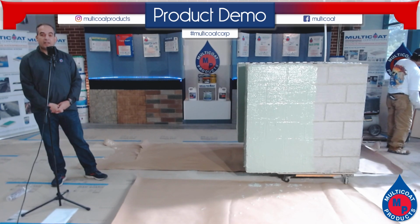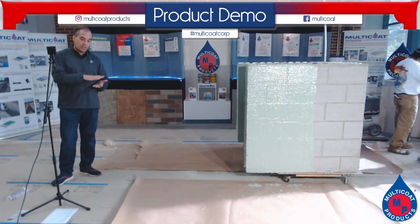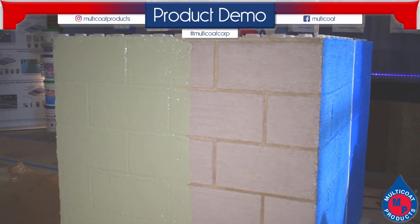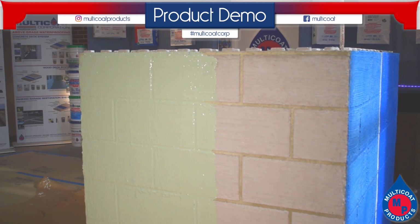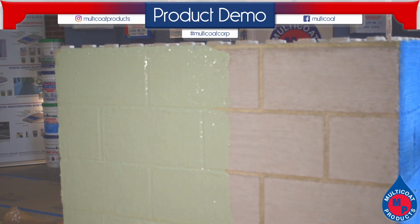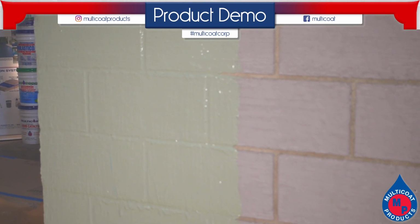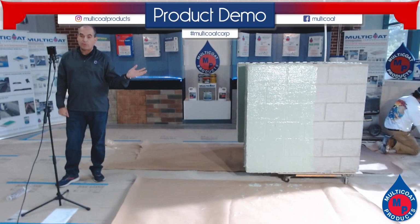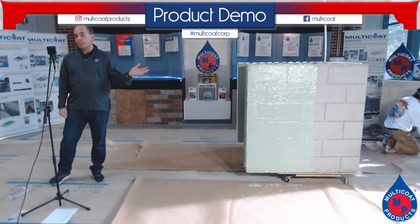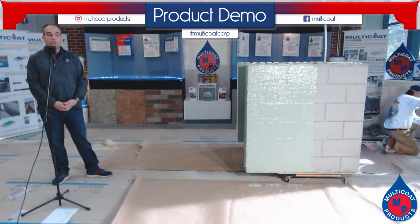Again, like I showed you the precast, we also do the same product on wood decks below lightweight concrete or gypsum. We have a system for that we can email you if you're doing a lot of gypsum or lightweight concrete decks. We think it's economical, and it also saves you a lot of time because this product dries so fast. Also, if you're a distributor, the shelf life on this product is like 18 months to 2 years, as opposed to 6 months for any other products with asphalt emulsion in them.